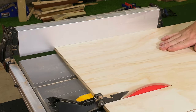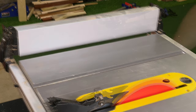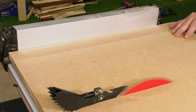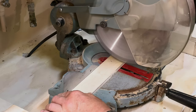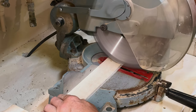Next I'm cutting the shape. I want the form to be a little thicker, so I'm using a three-quarter inch piece of MDF as well as an extra half inch — that'll make the form about a half inch deeper than it needs to be. That allows for extra spillover just in case you pour too much epoxy and don't want it running all over the table. Then lastly I cut out the exact lengths of all the sides and we're ready to put it together.